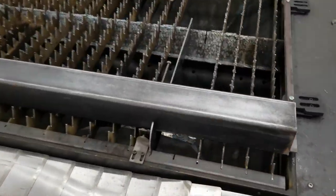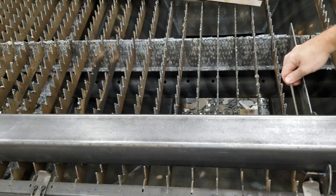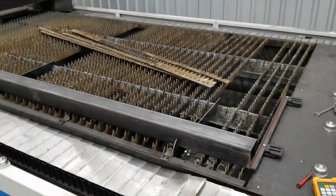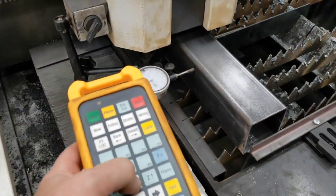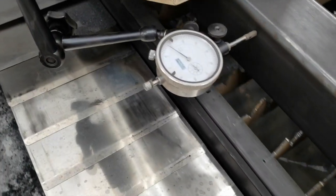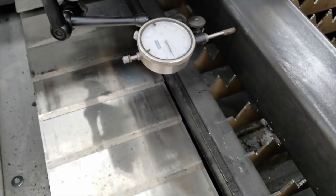The back end of this is going to need to go that way, so I'm just turning the adjustment here. I'm getting some pretty fine adjustment on it. We've got the indicator zeroed out, and if we jog this thing down you'll notice it starts moving forward, meaning the tube is too far to the left — it's pushing in on the indicator as we traverse down. It's pretty consistent, though it seems to ramp up and ramp down a little bit.